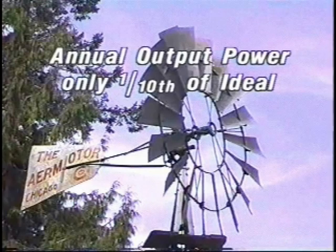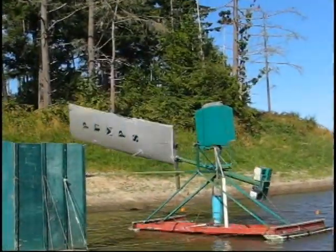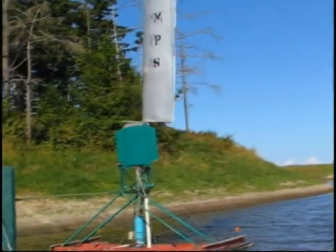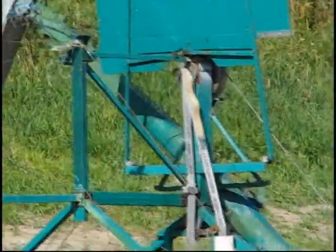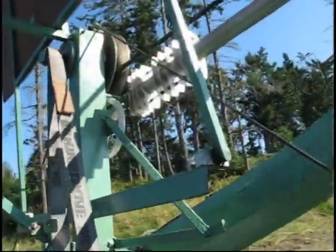The oscillating uni-blade is a much better match of the ever-varying wind to single-acting pumps against fixed pressure. The pump stroke of our winch with its spiral coils varies very strongly with the swing, not loading a starting swing in only two knots, but still absorbing all the wind power swept in a big swing in a good wind.